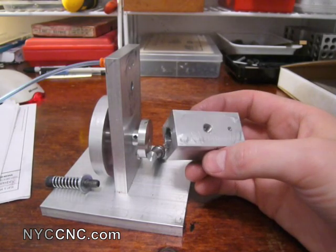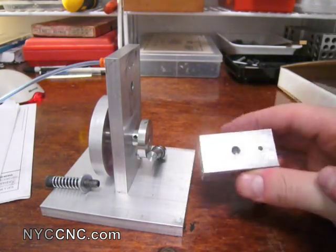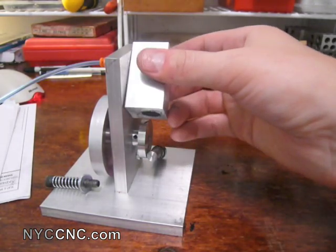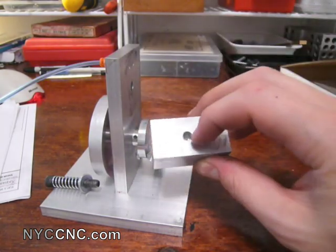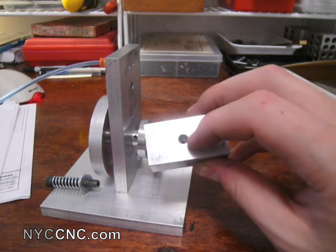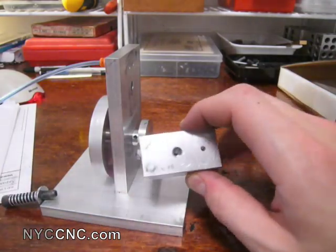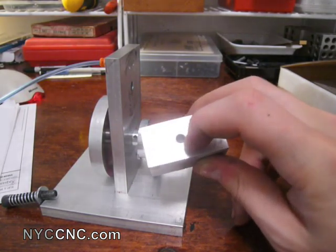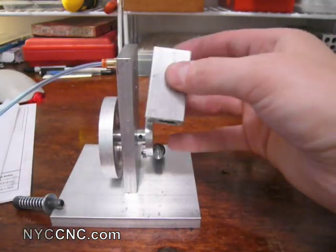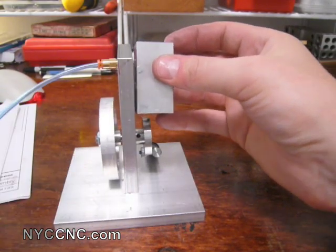While I'm showing you this, I'll just give a quick tip. I made two mistakes on it when I was making this, and unfortunately they were not the type of mistakes you want to make. The first mistake, which was a little easier to make, was this hole here, which is tapped. The only purpose it serves is to hold the cylinder up and allow it to pivot. That's supposed to be a 10 by 32 hole and tapped. And if you see, there's a hole all the way inside of the cylinder — that's not supposed to be there, the hole through to the cylinder. It doesn't actually matter because it ends up being plugged, but that's not good. The reason the hole is there is because I had to drill it out to a larger size. This happens to be a quarter by 28. The reason I had to do that was that when I tapped it for 10-32, I tapped it crooked — just a little bit, but crooked enough such that when it was pulled taut against the piece, it wasn't able to rest flat. It was just a hair off.